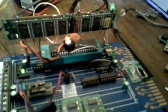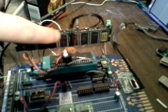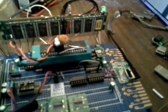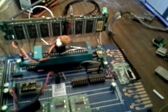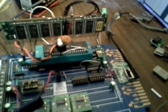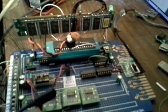the free running data, because yes, these lines are fed straight back between the data and the command lines, but they're also, you can sort of see some of the wires are also going to the processor. So when I remove the processor, I need it to be completely isolated when I do that. So we'll leave the power connected to it and we'll put it in reset.